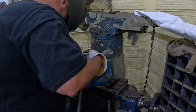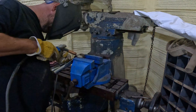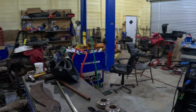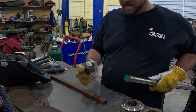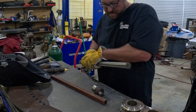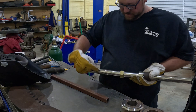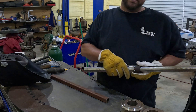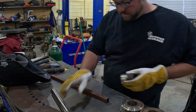I'm just tacking right now. I'm going to tack it in place and then bring you back over here where I can finish welding it. This is going to be mounted in the bucket of the track hoe. The pin is going to slip through all of this, and then this nut is going to be welded onto the shaft. When you push the shaft all the way in, it'll keep the shaft from rotating. It looks like it's lined up well enough — we can weld it.